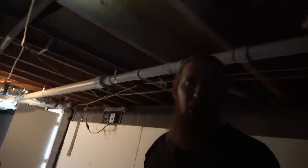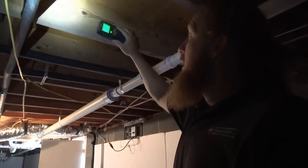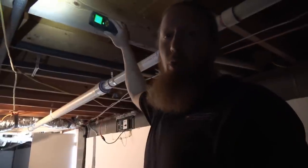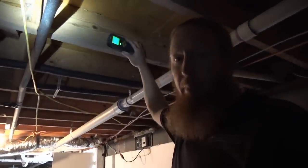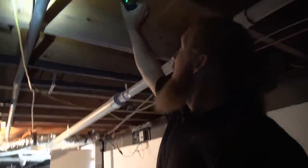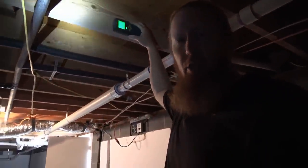One of the reasons I came here today is to see how the crawlspace is drying and whether we're ready to soda blast. I got my moisture meter and the wood is reading about 14%, which is pretty good. Before we removed the insulation, it was about 19 to 20%. So it is drying out even without a vapor barrier installed — the dehumidifier is strong enough to dry out the wood. The subfloor itself is around 10%, so we're low enough moisture-wise to go ahead and start addressing the mold.